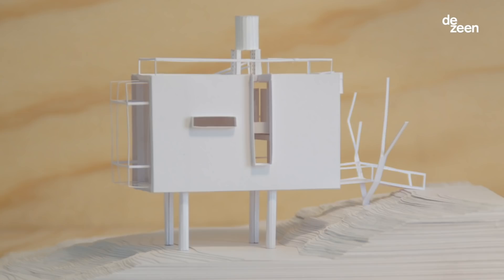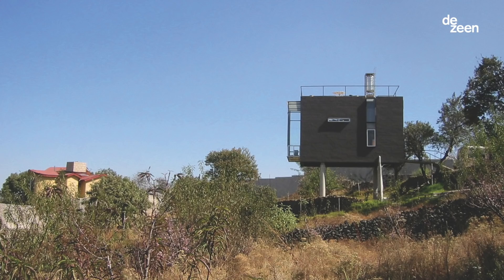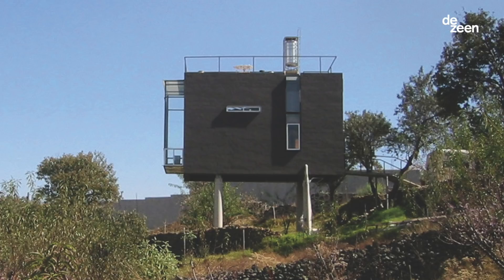When we were first thinking about the ideas behind this project, the Camera Obscura was one of the references, and we tried to work with that idea. It was about framing the landscape, but also, because it's in the hills in Mexico City, we had to come up with an idea to warm up the house. So we painted it in a very dark gray, so the sun would heat it up in the morning and in the evening it would radiate that heat. It was a very practical solution, but it also resembled the camera in itself.